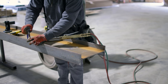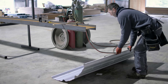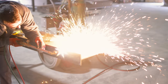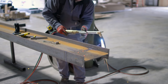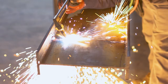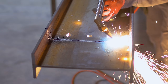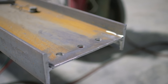To get this beam chopped up I'm using the oxygen acetylene cutting torch. A quick tip: when using a cutting torch on a concrete floor, put some sort of protector on the concrete because the sparks, slag, and metal droppings will chip and damage the floor. This tool is quick, simple, and easy — and since I have no mechanical bandsaw in this facility it's the best tool for the job. I like to start on the flanges, work top to bottom on each side, then connect the two cuts across the web.